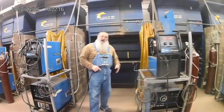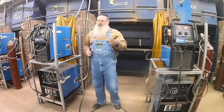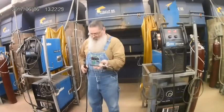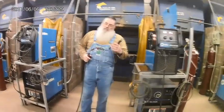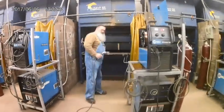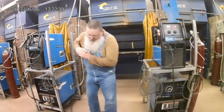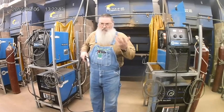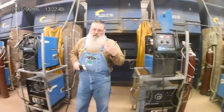Now the regular welding hazard still exists. The light, there's a little bit of smoke generated off of this. It's not like stick welding. The smoke is not as heavy, but there are still small metal particles that get in the air. With this ventilation on, they're not going to be a problem. Even out in the shop, not going to be a problem. Where they do become a problem though, is when I get my head down here like this welding, right over the top of it, smoke gets on there. If the smoke's getting on your welding hood, it's probably getting in your nose a little bit. You're not going to die from it.